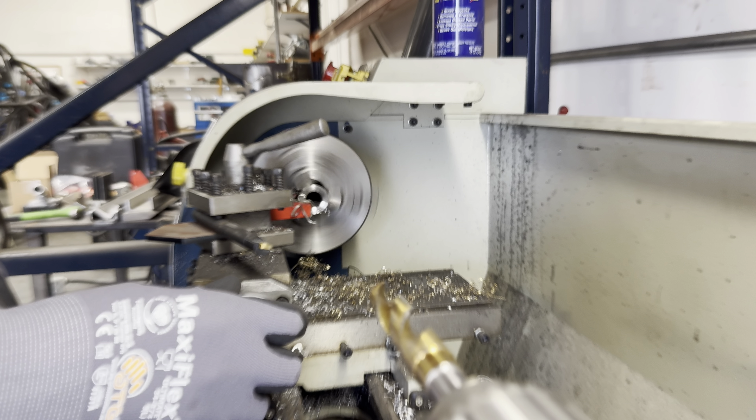The goal right now is to make this thing a roller — I don't want to have to do anything twice. Painting the trailing arms, gonna paint the A-arms complete since they're already fully welded out, going to paint the spindles fully. I know they're going to need brake line tabs, but the majority will be painted so the rest can be painted on the car. Using Steel-It even though it's $30 a can — you can't really beat the quality. Looks pretty much like powder coat.